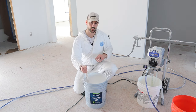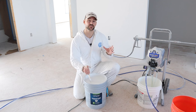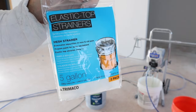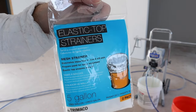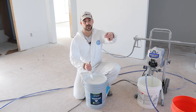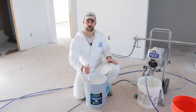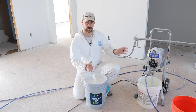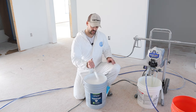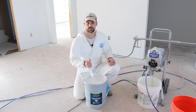I'm primarily going over spraying technique in this video. Something to consider for top performance is running your paint through a paint strainer first so any debris doesn't clog the sprayer. Graco has a reversible tip — if it gets clogged you just turn it, spray it to push the clog out, then turn it back. It rarely clogs with new paint, but with old paint you should definitely strain it.